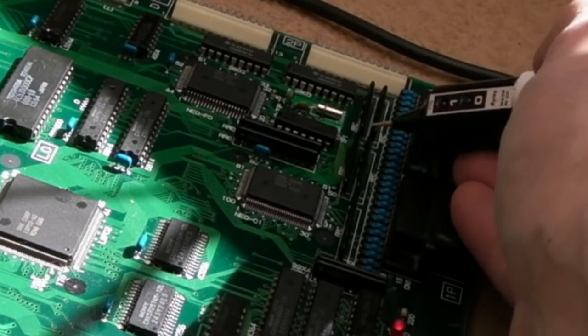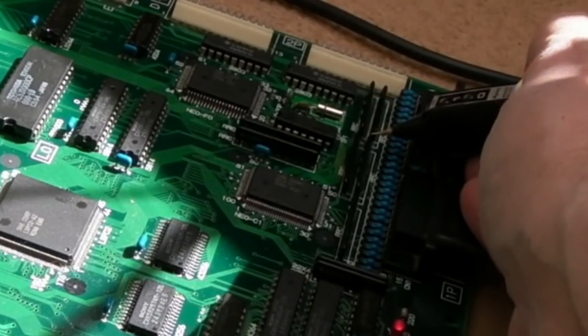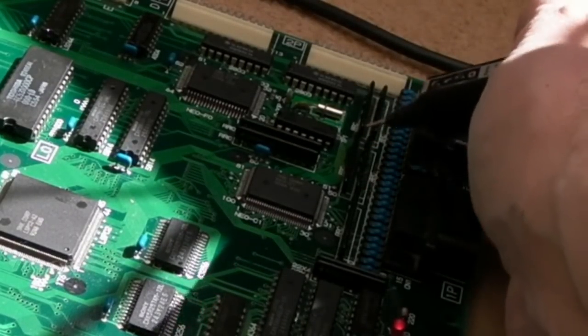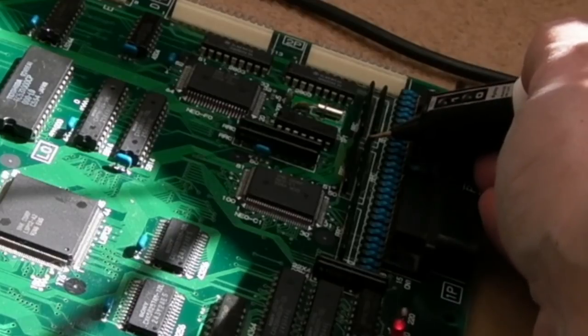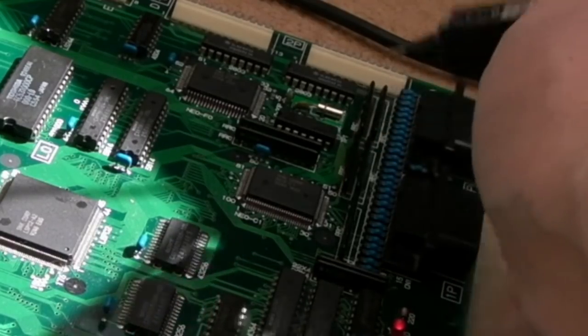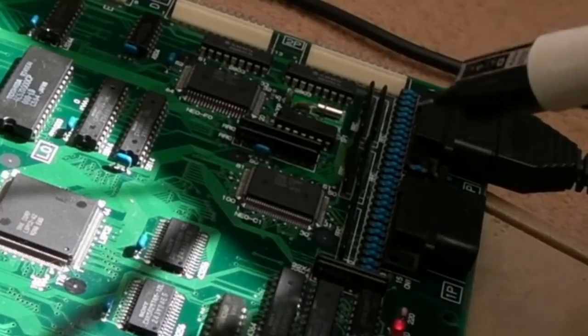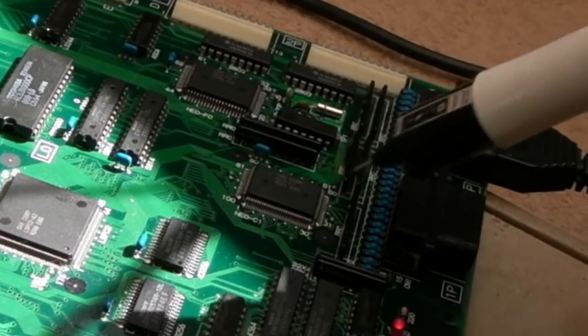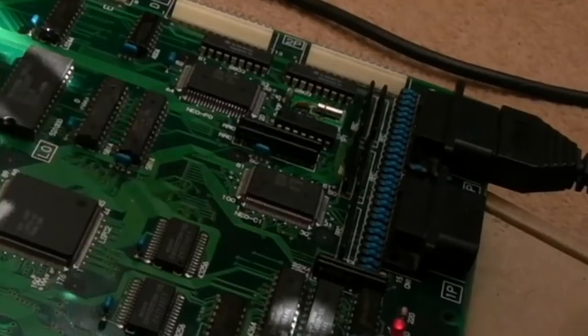And I've actually measured, I've gone as far as turning the board upside down, measuring in resistance mode between the first pin and then every other pin, the end pin and every other pin, and then between a pin and the one next to it, that one, the one next to it, and comparing each resistor pack. They're all absolutely identical. Sorry, I keep saying resistor pack, it's got a capacitor in there as well, but it's not those. Those are our common problem with the inputs.